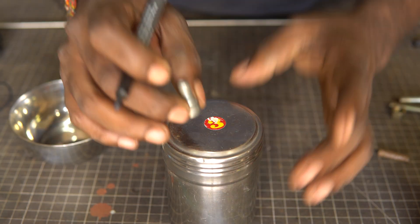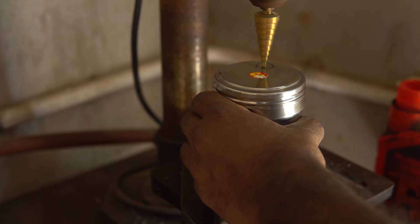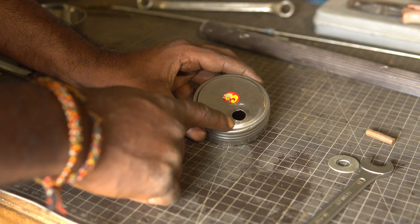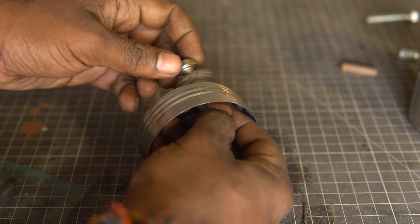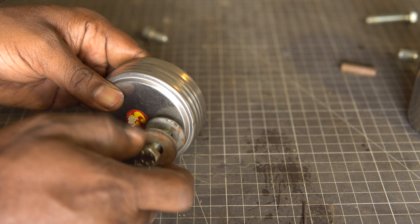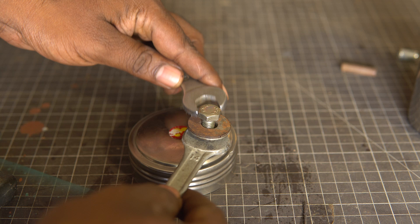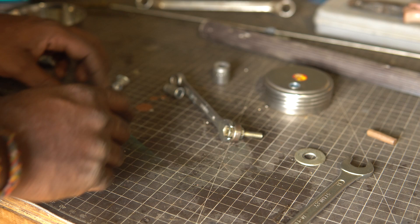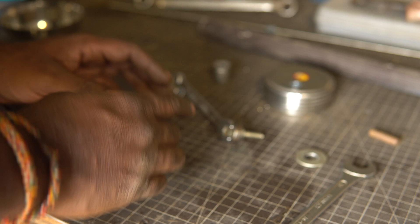Starting with the lid on the top container, I marked placements for the water inlet hole. I was skeptical if this drill bit would even drill stainless steel, but since the metal is very thin it worked out. I drilled a hole on the top lid and wanted to attach a rivet nut. To attach a rivet nut you need a special tool. I've seen many YouTube videos showing how to attach a rivet nut without special tools using a bolt and washers, but in my case the rivet nuts were getting spoiled, the threads were getting cut, the nuts were getting jammed — lots of issues. That technique works for a lot of people but not in my case, so I had to think of a workaround.